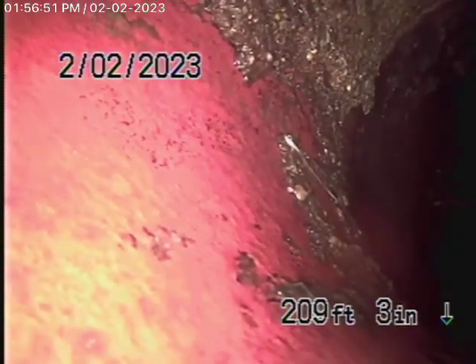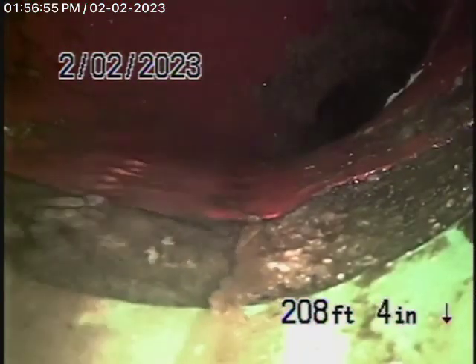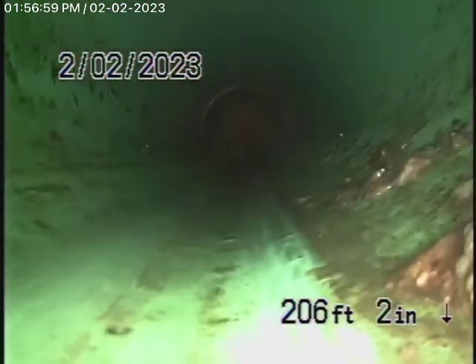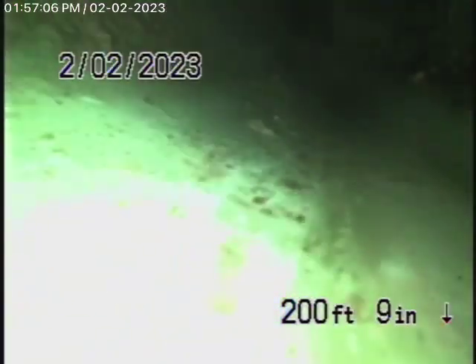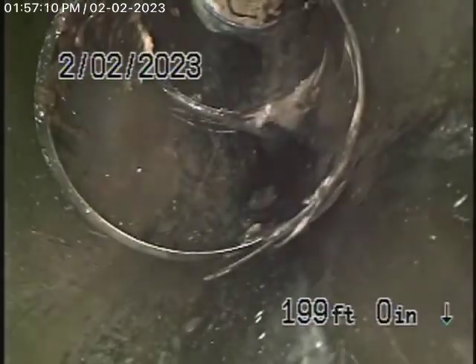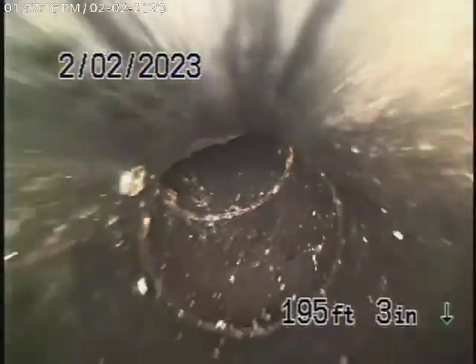Here's your connection to the city. It comes back right away to an SDR35 plastic sewer line. The connection to the city was a clay 8x6 connection, and then it came back to an SDR35 6-inch lateral. It then comes onto the property and changes to a 4-inch ABS plastic pipe, which runs all the way down the driveway.